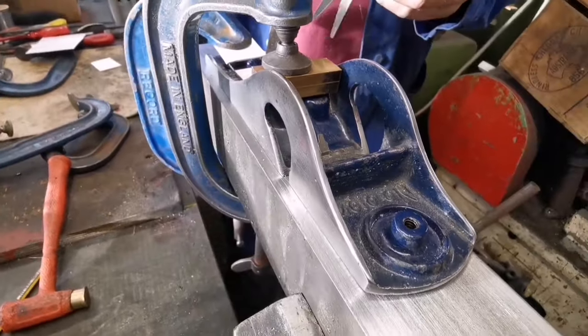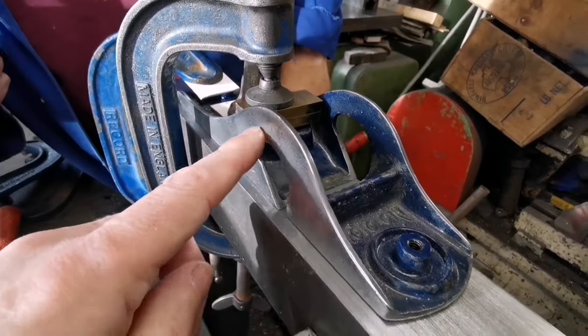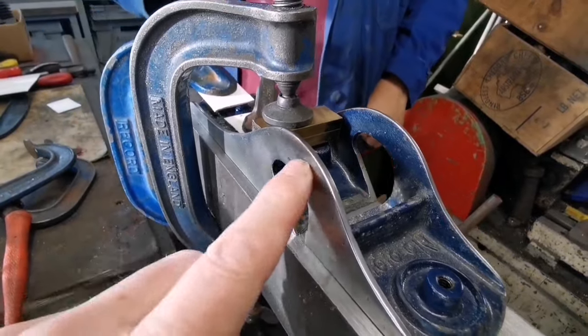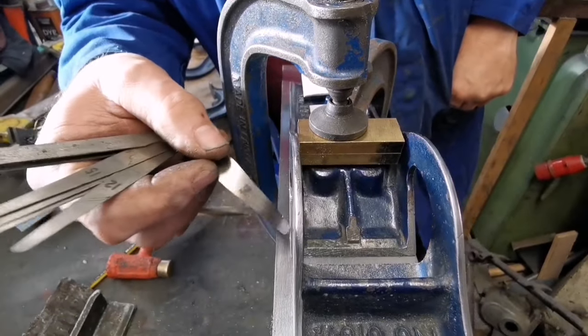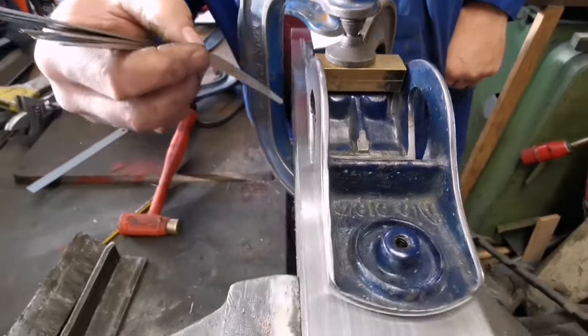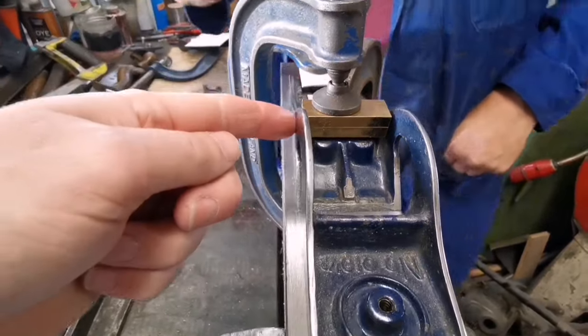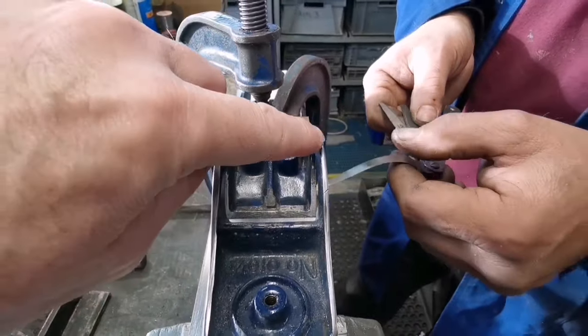And the buckle, we chatted about this the other day, Robert and I, the buckle is actually there, isn't it? Yeah, it's that area, that's got the most twist. Because it isn't a straight line down there now. Yeah, you got a thou and a half. It's quite weird because Robert and I discussed it. This one's got all the bend in it, and this one's not far off straight.